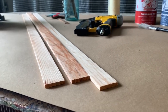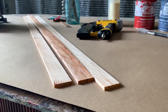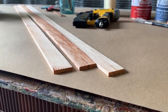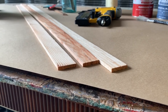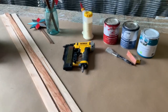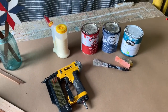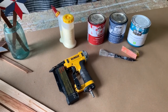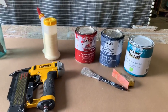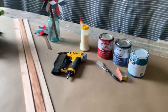We are working on garden picks today. You don't want them too heavy or they might tilt over in your pots. If you don't have access to lath at your hardware store, you could take a two by four and just rip it down into thin strips. We also have a pin nailer, which you may or may not use — the pieces are so light that wood glue will hold it, but I'll do it both ways for you. And then we need some wood glue, a little sander, paint, and a paintbrush.